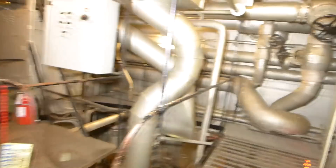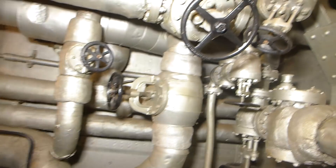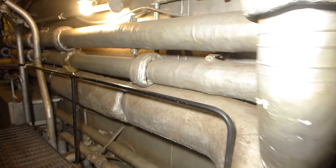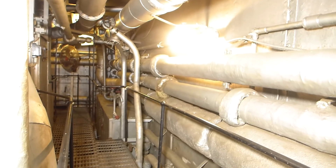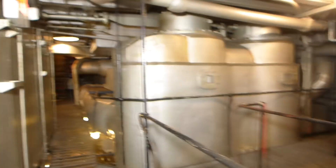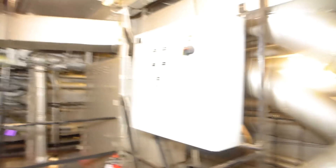Walking a little further aft, we see auxiliary steam lines. These hook up to take lower-pressure steam — generally around 150 pounds or maybe as low as 25 pounds — and that's what's used to run all the auxiliary pumps and steam-operated compressors. Now we're going to go ahead and go down to what we call the mid-grate.